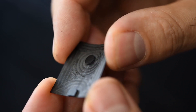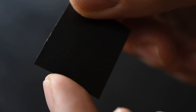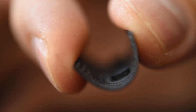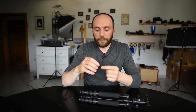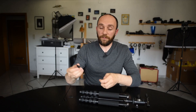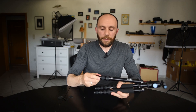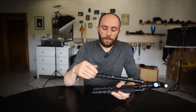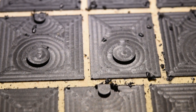These shims are very flexible, so you can easily install them. However, since they were machined as a flat object, those round stoppers are flat as well. So when you bend the 400-micron film, the 1.5mm pin does not bend at all. The good news is they fit in; the downside is that the leg doesn't slide as easily in and out. But I consider it a success because I can easily machine and replace them whenever I want.